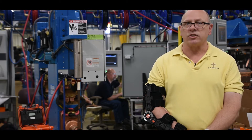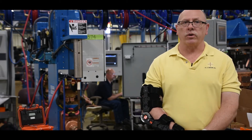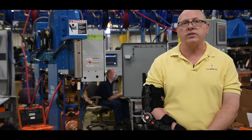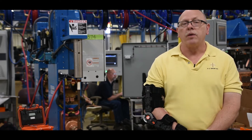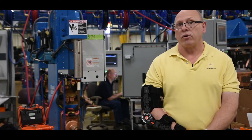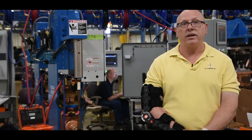In the case of resistance welding, large amounts of current are produced — we're talking thousands of amps in the majority of cases in order to produce the end result — but being produced at a very low output voltage of about 15 volts or less, and that can be AC or DC.